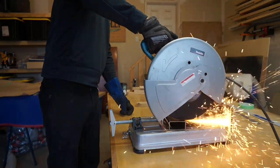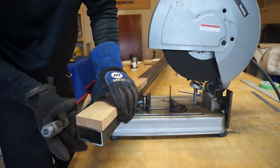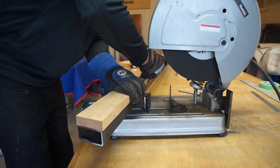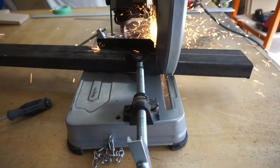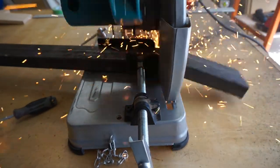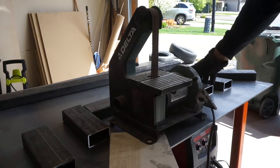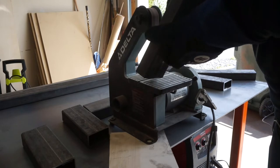The first thing I did was cut the three inch by one and a half inch steel tubing to the correct lengths with my abrasive cutoff saw. I actually made a replica of the fabrication out of some scrap wood to make sure all of my dimensions were correct. All of the steel components were cut at a 10 degree angle, and I needed to make sure the angle would allow the walnut extensions of the leg to stay within the tabletop. Having the wood pieces to reference made it a lot easier to both set up the saw and measure out the steel.